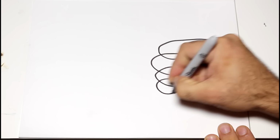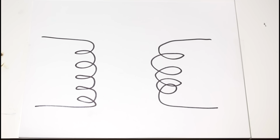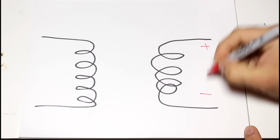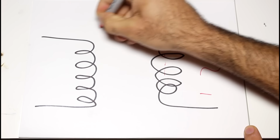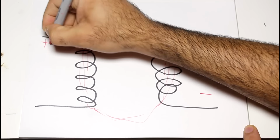See, the wireless power is done by making a transformer. In a transformer, you have a primary coil and a secondary coil. When you run alternating current through the primary, you create AC magnetic fields coming out of the primary that pass through the secondary. And those fields move electrons in the secondary and create AC power output. I've made two coils, one for primary and one for secondary. And as for my AC power source, I'll plug my primary into the 120 volt AC power line. Don't plug your artworks in 120 volt AC, it's too dangerous and low frequency.